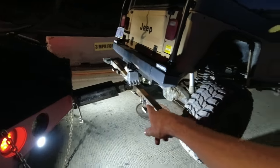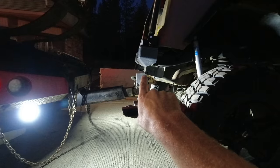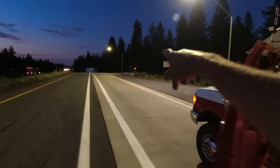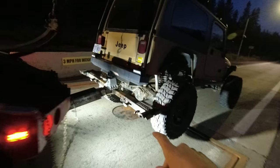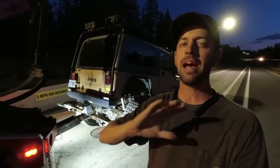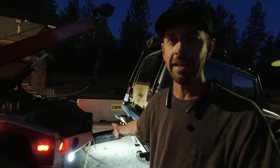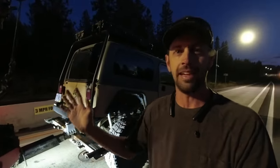I had to get a little creative there because the wheel lift wouldn't pick up high enough for the amount of suspension droop this thing has, but now we are picking up from slightly farther in than what the sling was doing. All the weight is now on the wheel lift, which is behind the axle of the truck. And what does the scale say? 9,250 — only 50 pounds heavier than we had on the sling. I attribute that to the fact that we're not picking up from quite the same point. From there to there made an 800-pound difference, so that could easily make a 50-pound difference. The simple fact is: when it comes to weight transfer on the back of your wrecker, it makes absolutely no difference whether you're picking it up off the wheel lift or off the boom.